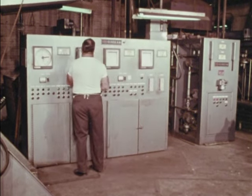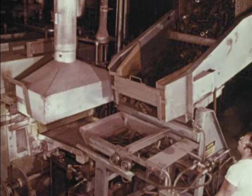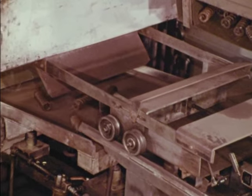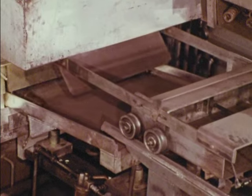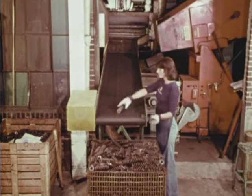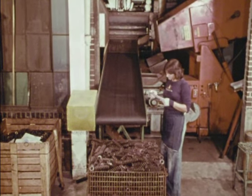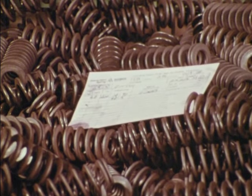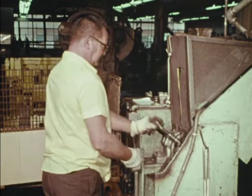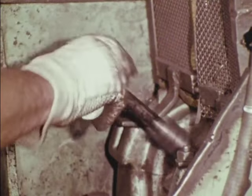Small batch heat treating of springs in furnaces of the optimum design under rigidly maintained conditions assures you the correct Rockwell hardness, the specified steel temper, the exact tensile strength required for the spring's design. Charts and records from this and following manufacturing steps accompany the springs from station to station, giving the batches full pedigree to Raymond quality control personnel. Under maximum load, ordinary springs will take a set, not return to their original free length, become shorter, and lose their load-producing ability.